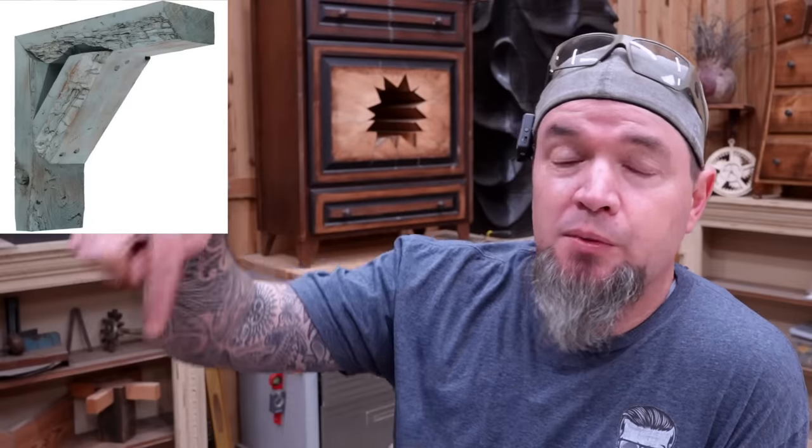The board that goes against the wall is 10 inches long; the board that acts as the bracket is 8 inches long. All they've done is cut 45-degree angles on those two boards, put a couple of screws in from the top since it's going to have a board on top of it. For the support bracket in the middle, it's about 6 inches long with a 45-degree angle on each side. To make this look rustic or farmhouse, they've taken a framing nailer and toenailed in some nails to hold that into place — you can tell because the nails are actually inset into the wood. Then they've roughed it up some more. On the edges where the bark was showing, they didn't have to do anything since that's on half the two by fours you find anymore. They've taken hatchets to make some marks and used a screw to hammer in screw marks. I would have used a square nail instead for a more rustic look.